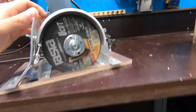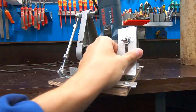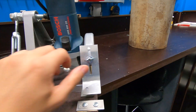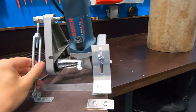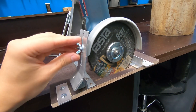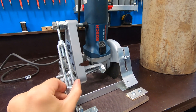I modified it slightly to allow the abrasive disc to move up and down. To achieve this, I installed an adjustable mechanism. By turning this mechanism, the angle grinder moves slowly up or down. There's also a clamping screw to lock the AG in the adjusted position. One full turn moves the abrasive disc approximately one millimeter.